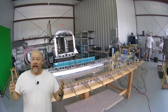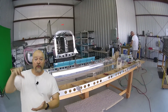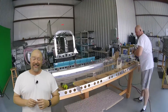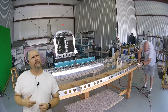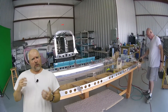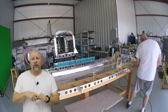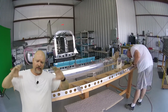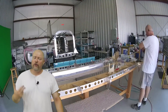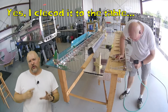Once we have all the skins and all the parts dimpled accordingly, it's time to start final assembly. We go through and start putting everything back together, getting that skeleton all riveted together. That's a lot of riveting with the round-headed AN470 4-4 rivets. It's really awkward — you'll see me go back through and try to figure out how I'm going to do it, flipping the piece around. It took forever to finally get comfortable. I was trying to use the squeezer but there was just no good way to get in there.